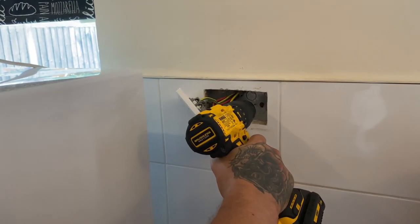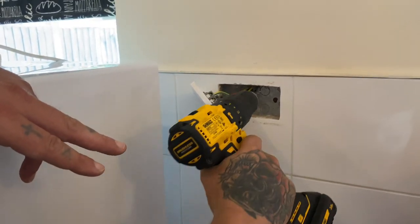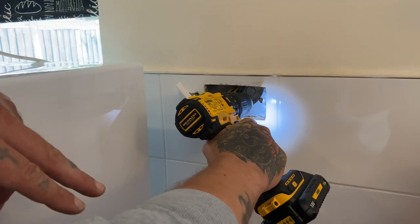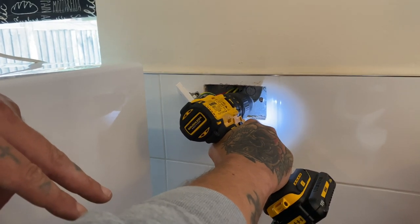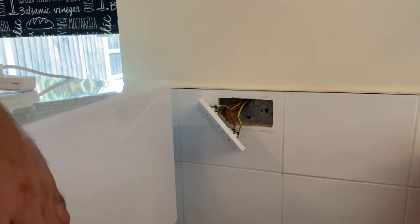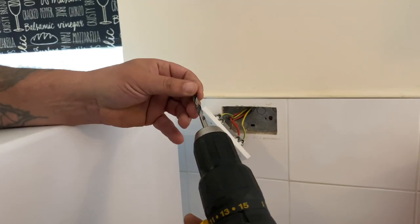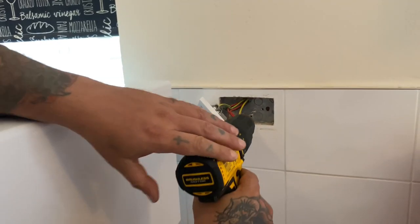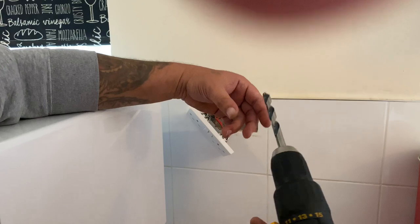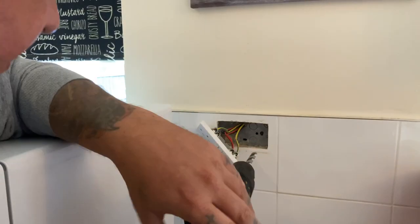Initially you need to make a small pilot hole in the back of the steel back box — make sure you use a steel drill, not a masonry or wooden one. First do a small pilot hole with a three millimeter, then go through with a six millimeter next. For the final cut in the steel back box, go for a ten millimeter — same again, steel drill.